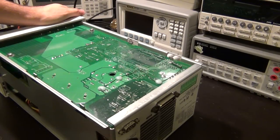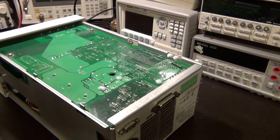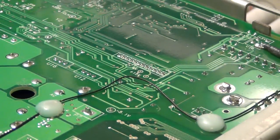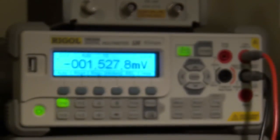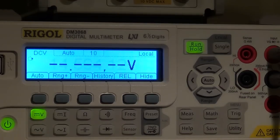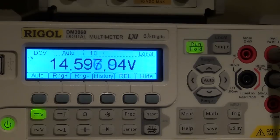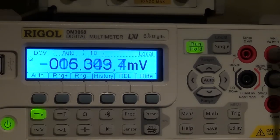With the magic of television, I've reassembled it — took about 10 minutes, everything fit, no extra screws, which is always a good sign. It's plugged in again, and if you remember, this was the spot giving me the wrong voltage — I wanted to see +15V there and wasn't getting it. Going back to the multimeter and powering the instrument on, the +17.4V region still reads 18V — perfect. And here's +15V now reading 14.59V. Before it was -0.8V, and now we have 15 volts. The zener diode is doing its job.